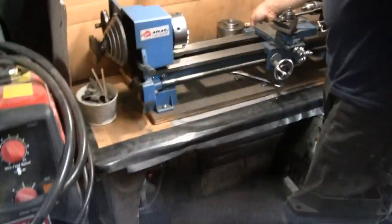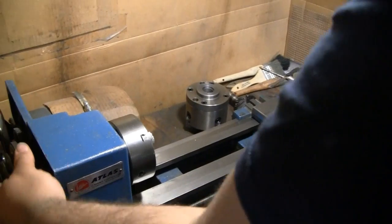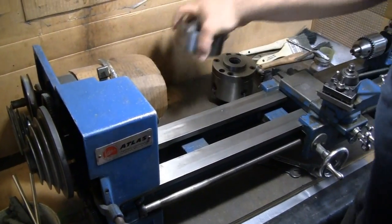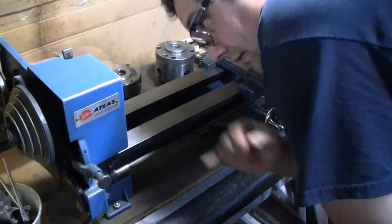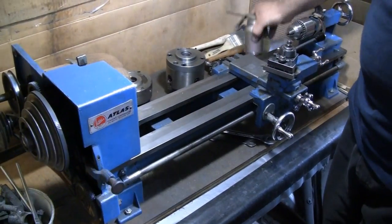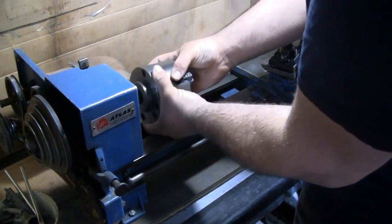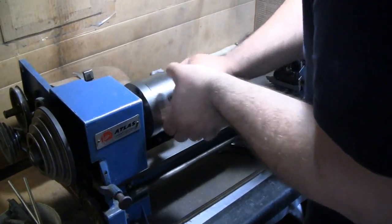All right, let's see what's going on over here at the big lathe. Yeah, I meant to clean this up for you, buddy, but I got busy today. Oh yeah, well, I already loosened the 3-jaw chuck just on threads there. So set that aside. Actually, we'll set it like this. Make sure we don't have anything on the spindle where the chuck's gonna seat. Put a little drop of oil on there. I did. I filled that for you too. Thank you. It's a big hunk of chuck there, huh, buddy? Yeah, first little lathe.